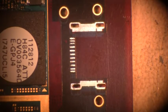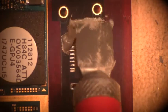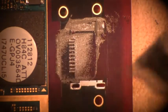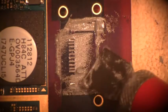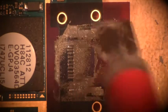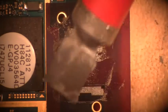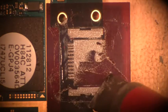The next thing I want to do is fill the little holes and pad sites with some solder paste. I don't want to do the big aperture holes, so you've got to be very careful in that area because these are your ground planes. I'm squeezing solder paste into these holes up here — these are where your connections are, and these are your ground planes. Just be very careful not to get it where it's not supposed to be, and make sure you get plenty in the ground plane area, because that's your connection to ground and it holds the connector in place.